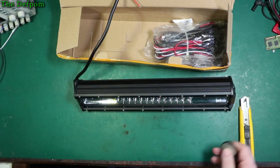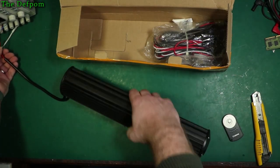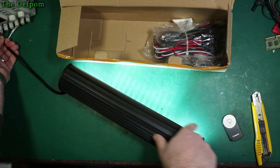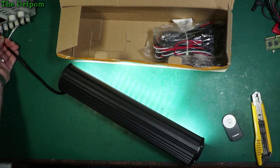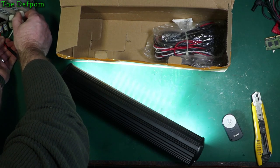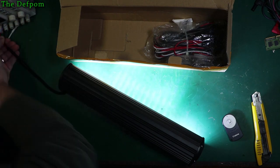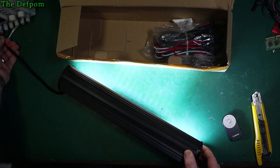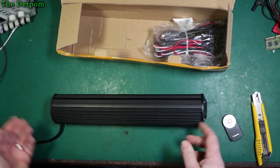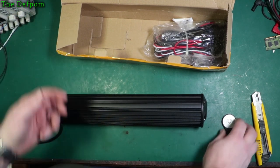Let me just quickly power this up and give it a go. That's current limiting at one amp — I'm just touching on the power supply. You can see these ones are focused and those ones are flood. If I increase my current limiting here... that is now doing 5 amps and I'm running out of power supply. That's definitely pretty bright. And that's still currently limiting at 5 amps, so that's fine. It's going to do what I want, at least. Yay.